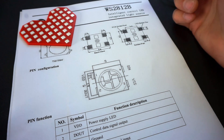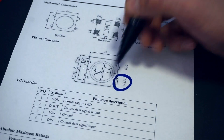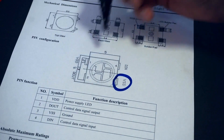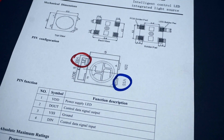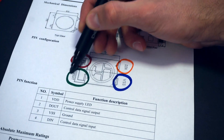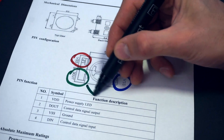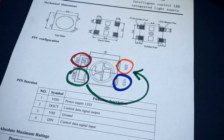This was an easy part, now the hard part will be to connect the LEDs together. These are my favorite WS2812 RGB LEDs. They got only four leads and serial interface. They got two leads for power, ground and plus 5 volts, and two for serial interface: there is data input and the data output. The beauty about these is that if you chain data output with the next data input, you can control the strip of them with just one wire.